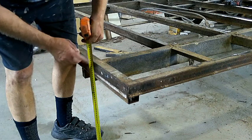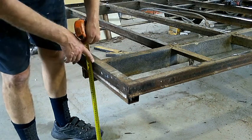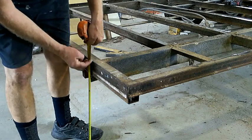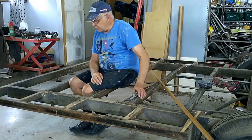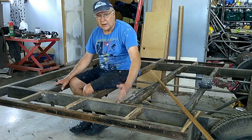At the moment the caravan chassis is 510 millimeters off the ground, which means I can drop this tail 110 millimeters. The final question is: how far from the tail of the trailer should I make the cut to drop it?